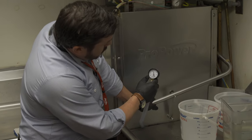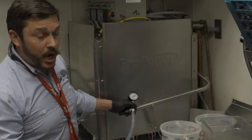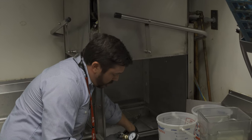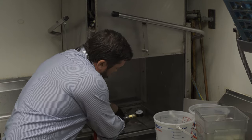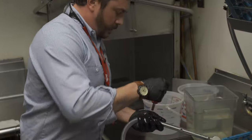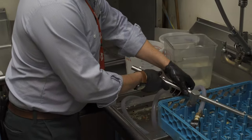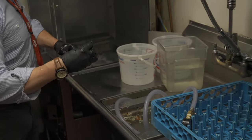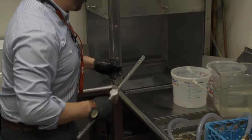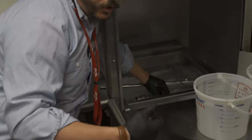You can see that this machine's washing right around 12 pounds of pressure. Pretty much I stopped the test right there — we have a 12 pound wash pressure on this machine. Now all I do is undo my hose, put my end plug back in, and I'm ready for my next step. The next step I always do is test how much water is in the machine — the standing water level is where this machine fills to constantly.